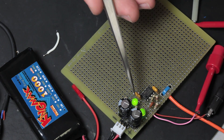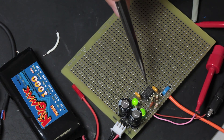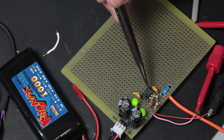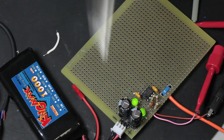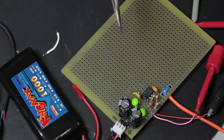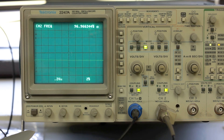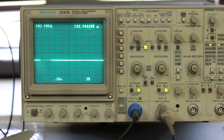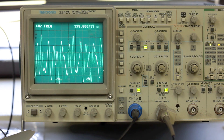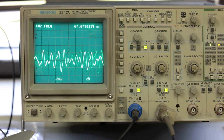Differential amplifier, got a couple of LEDs on here. No switch — big deal. When I first wired this up, it was sitting on the negative rail at −3.7 volts on the output because I had the power wired up backwards. But I wired it up normally, did not fry the op-amp, and now it's functional. I'm just going to hit an A. To the untrained eye that may look like garbage, but that's actually a pretty clean waveform — there's no railing, no clipping on the signal.